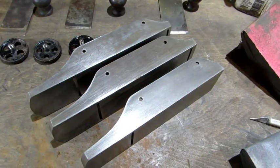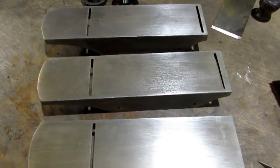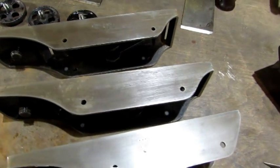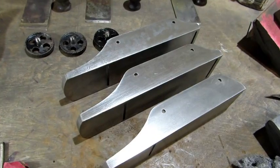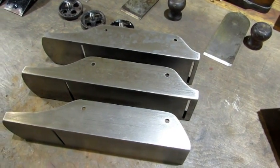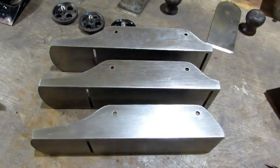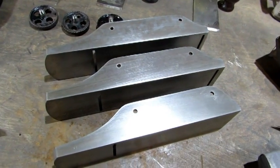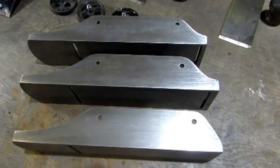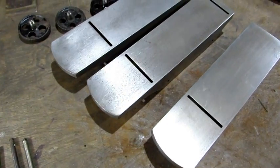This is what they look like after the 150. You work the paper and apply pressure where you need to in order to even out the patina. Next is the sanding sponge — went over them, didn't take long, maybe 30 seconds on each one, just smoothing them up and evening that patina out a little more. Then I hit them with 3000 grit paper. All the sanding was done front to back in the same direction as the original machine marks — otherwise you're going to mess it up. Here's a quick look at the bottoms.